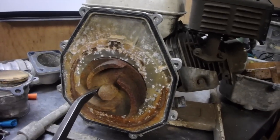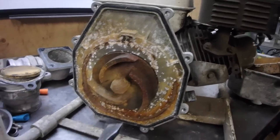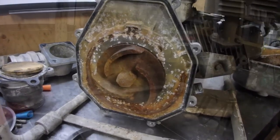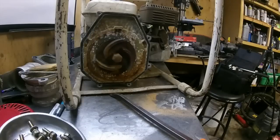The fluid comes into the middle, inside here, and as it comes around it goes out. It looks backwards, but that's the way it works. How to determine pump rotation by impeller design: impellers must turn in a direction so that the fluid is pushed, not scooped, through the pump. Exceptions are pumps with straight vane impellers — vanes perpendicular to the shaft — and shrouded impellers. Straight vane impellers function in either direction. Shrouded impellers turn so they scoop the fluid.